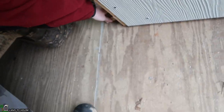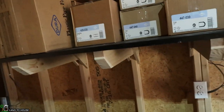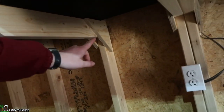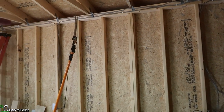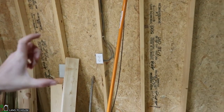I've got my template piece cut out already. It has a little chamfer and it's 23 inches so that when you put two-foot plywood on top it doesn't extend over the edge, and it should be plenty strong. For these new shelves I'm going to do longer, bigger triangles for better support because it's going to have a lot of heavy boxes. I may even have to put a couple of supports on the front — it won't look as nice but it will be much stronger.